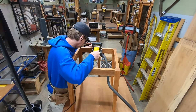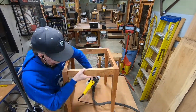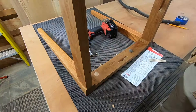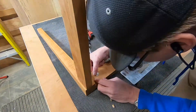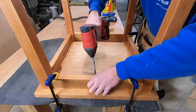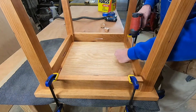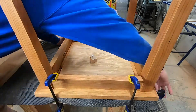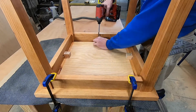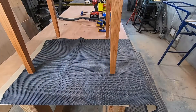This is how I'm going to attach the top to the base — I'm using my plate joiner and making two passes at it, changing my depth, to give me a little slot. And laying in my Oregon State Quarter, which is kind of my trademark. Here are the little buttons — I made a little L out of scrap wood with a little screw, using a stainless steel screw here, and just lining the top up. These little guys will allow the top to move independently from the base — if the weather changes where this is going, it gets hot and cold, so this will be good.